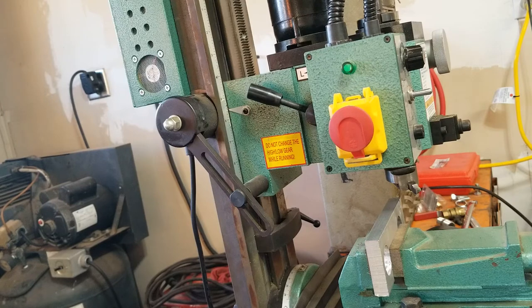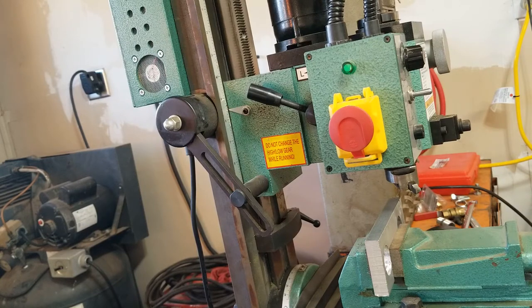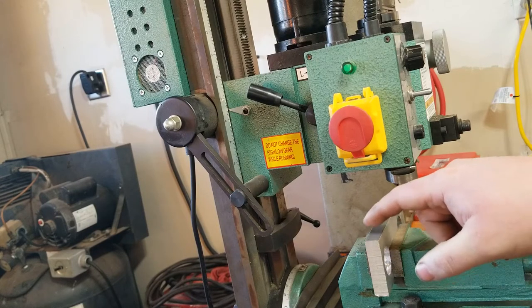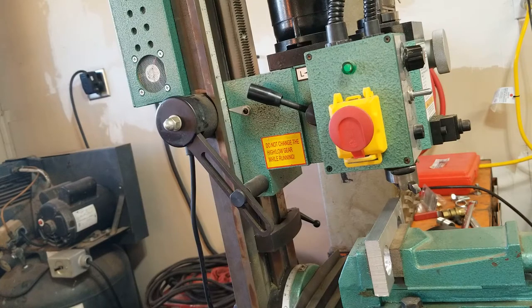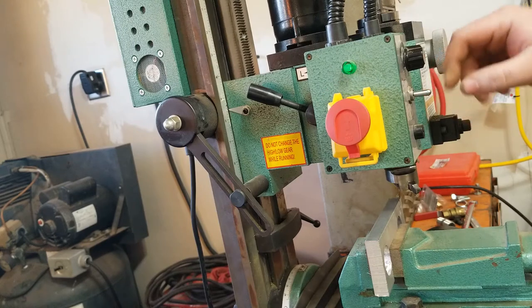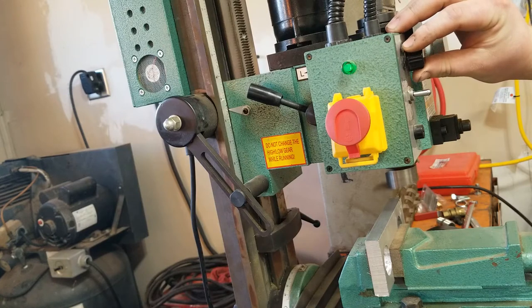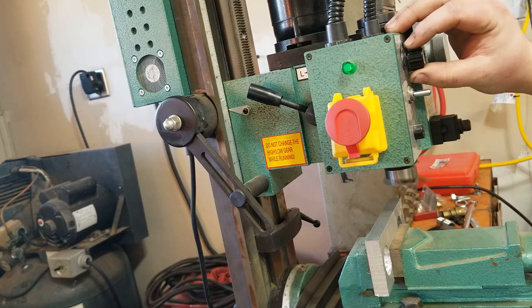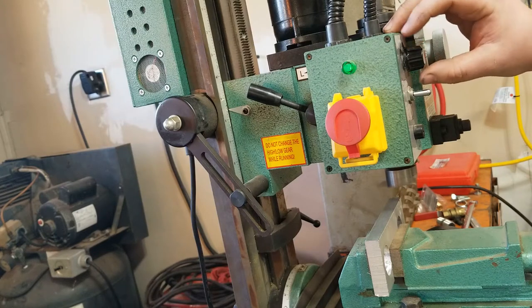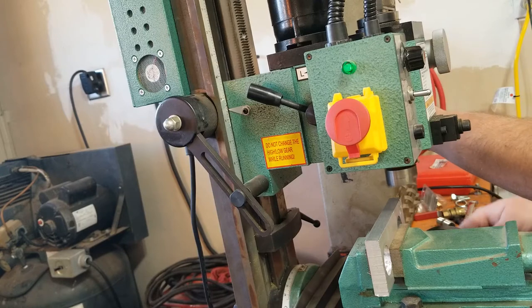All right, everybody. So we are at the mill. So I got this block of aluminum and we're gonna cut it vertically first, so it's not cutting as much material. Maybe give it a chance to actually function before we attempt to destroy it and break that collet. So, without further ado, let's do scary things. I start getting vibrations at a little over probably 500 RPM, so we'll just run it around 400, 450, and see what she'll do.